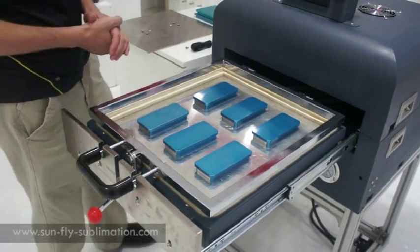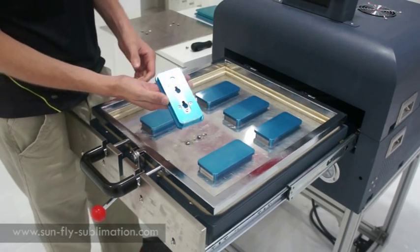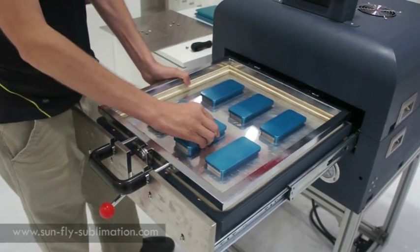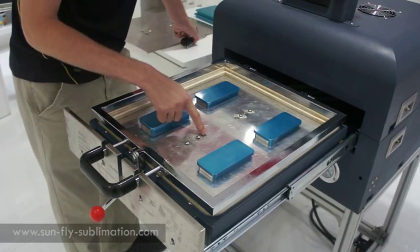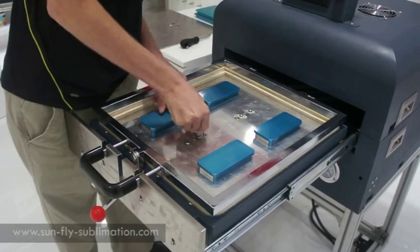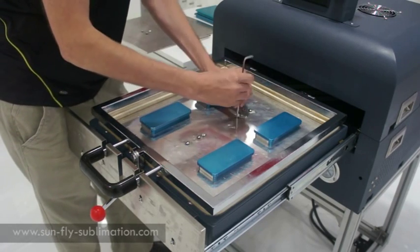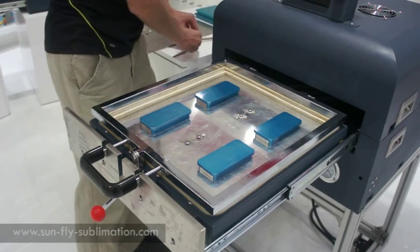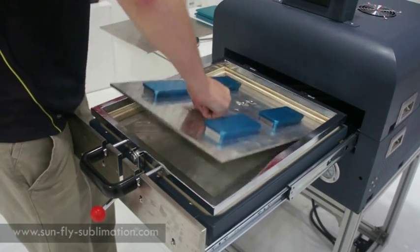You don't need to lift the cage at all — you can leave that down. What we're going to do first is remove the jigs, just slot them down. It's almost like one of the old cassettes — you just slot it in on the screws and it will slide in or out. Pull these down and you'll notice the Allen screws here — we're just going to loosen these first and undo them. To remove the platter, we put the screw in one of these holes, just a couple of threads, and then you can lift it off.